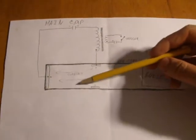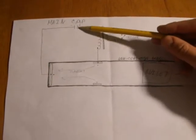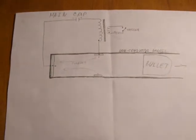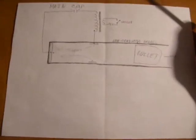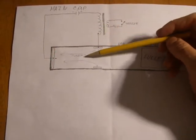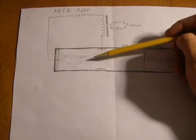The expansion of this heated air propels the projectile. In this case, all the energy of the capacitor is used to heat up the air and propel the projectile without any combustion material. The drawback of this design is that to ionize the air between electrodes, really high voltage is required.